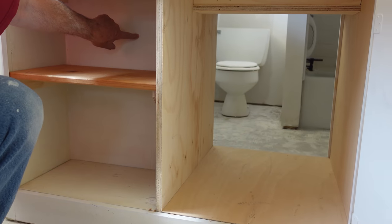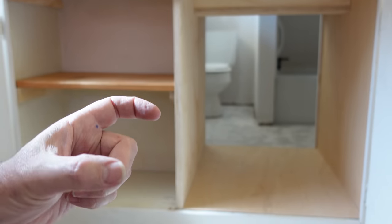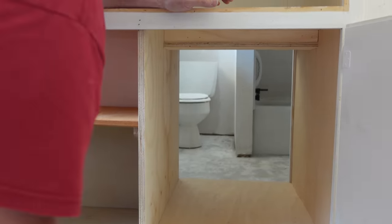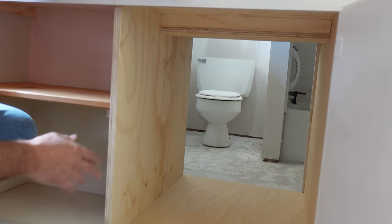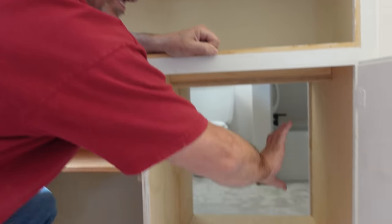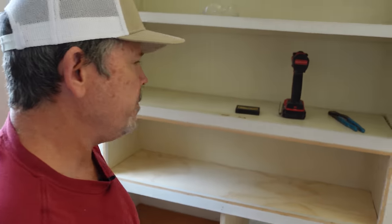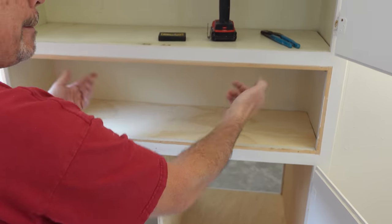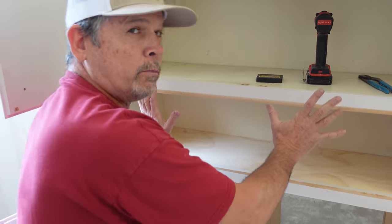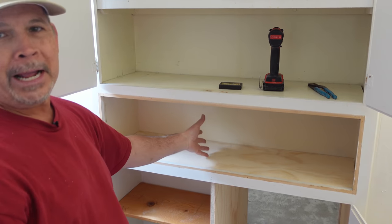This wall is half-inch drywall on both sides with two-by-fours on the flat, so the thickness was only about two and a quarter inches. I removed the drywall from both sides, cut the studs — it's a non-load bearing wall — and filled it in with plywood. A three-quarter-inch piece is my partition, and I had some eighth-inch plywood for the bottom and right side to cover the holes. We removed the hinged door that used to flip in like a clothes hamper — clothes just fell on the shelf, kind of a goofy idea — and put in an open shelf where she can roll up towels, put knickknacks, maybe some plants.